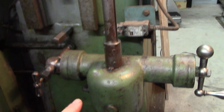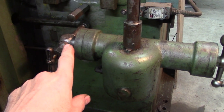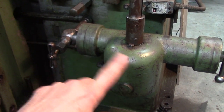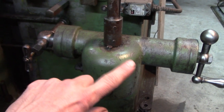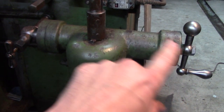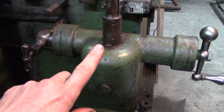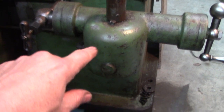So I said all that because how this works is the piston goes back and forth with the table, right? It's back and forth. So the rack goes back and forth. That's just a stroke limiter for the rack, so that sets your step over. That's how that works. So that shaft has got to go a little bit at a time, for advance and step over.